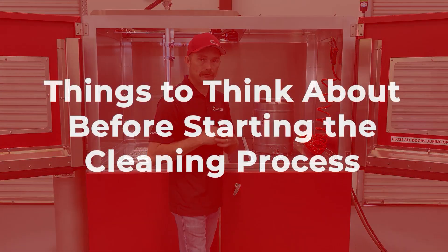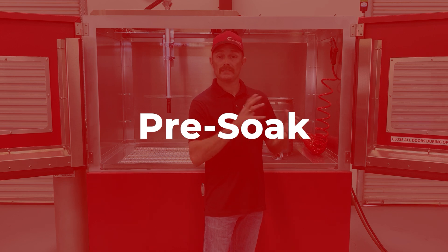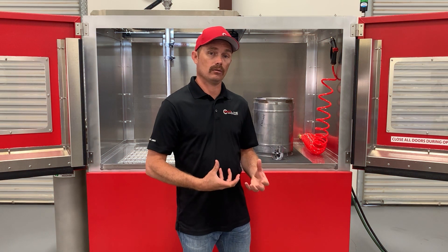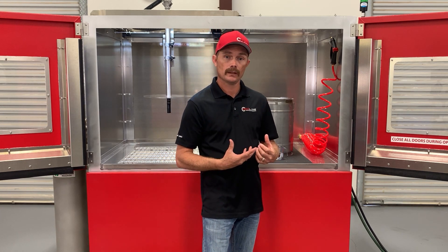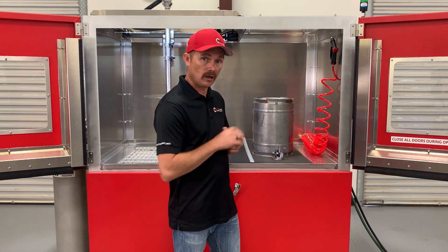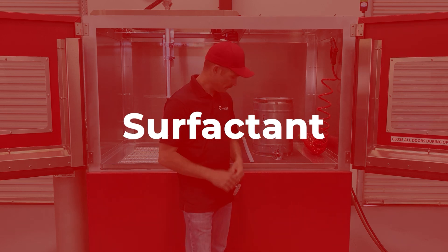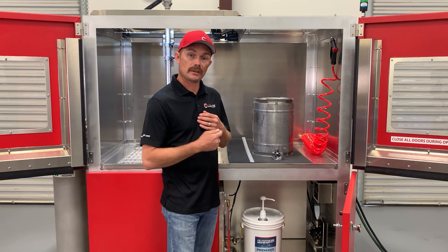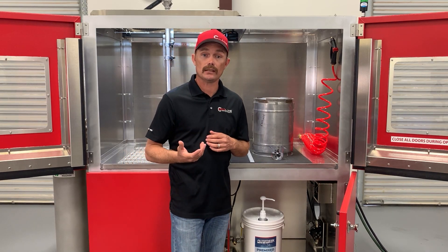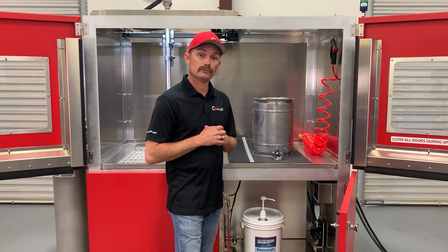We have the Aqueous machine open and we're ready to start cleaning a heavy-duty DPF. On the right-hand side of the machine is the pre-soak side, where we place the DPF with the flat flange down. We'll plug the sensor bungs before placing the filter in. You can service multiple filters at a time by pre-soaking a couple simultaneously — place them with the flat flange down on top of the rubber mat. Every DPF we service gets four ounces of surfactant. The surfactant comes from the tank underneath, and each pump equals one ounce, so four pumps equals four ounces.